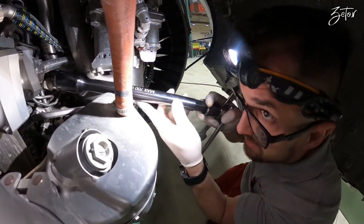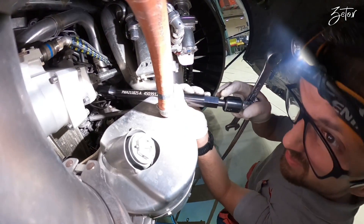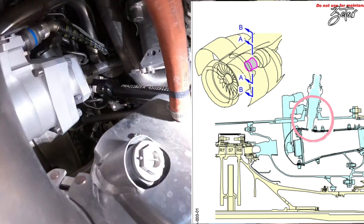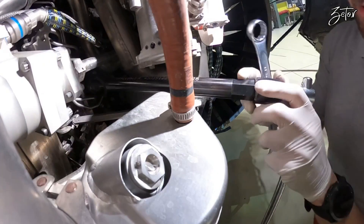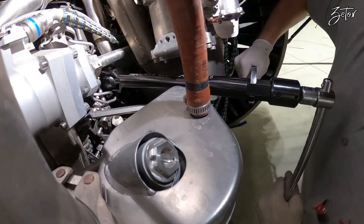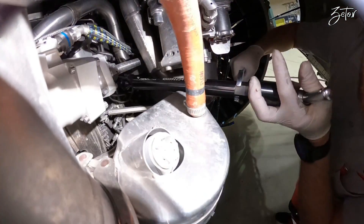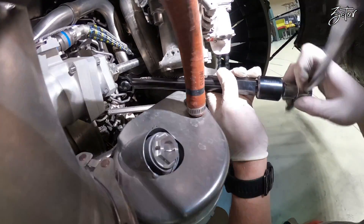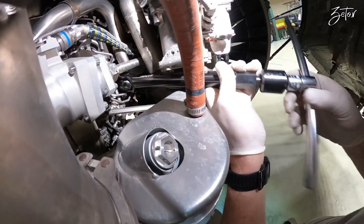For the igniter plug removal we must use this adapter, and the reason is that the igniter plug is installed on an insert. If you do not use this adapter you can lose this insert, and the igniter plug spacer thickness will need to be calculated again. Be sure that the igniter adapter body properly sits on the diffuser case insert, then hold it with a wrench as a counter-force against loosening of the igniter plug. This way you can be sure the diffuser case insert remains in position and you can remove the igniter plug without further problems.